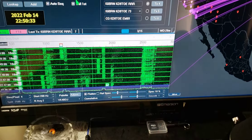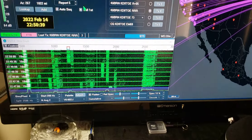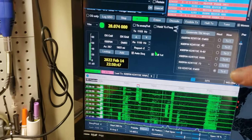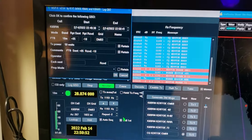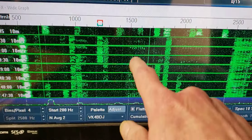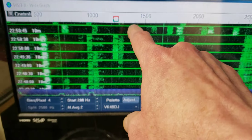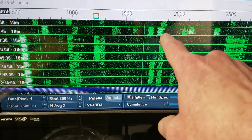Quit trying to use your DX power to transmit on FT8. Just use your radio - that's all you need. At 50 watts, that guy is over in California. You can see my receive - he received me at minus 10. Minus 10 on this scale looks about like that. That other guy is running plus two, plus three, plus five - that's how loud he is because he's running too much ALC.